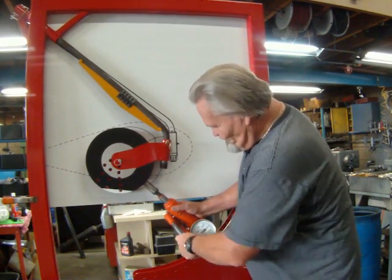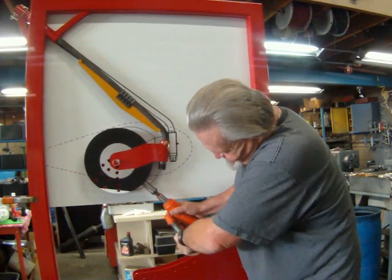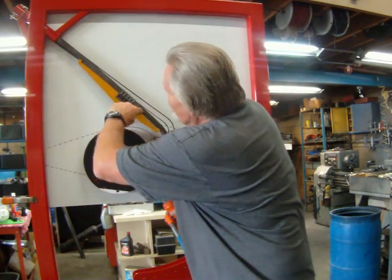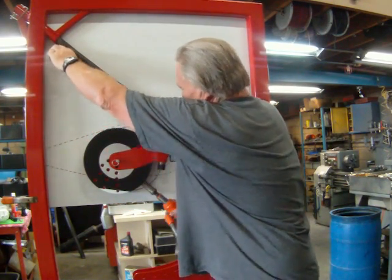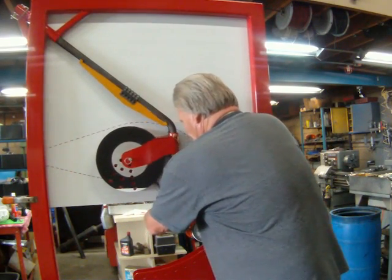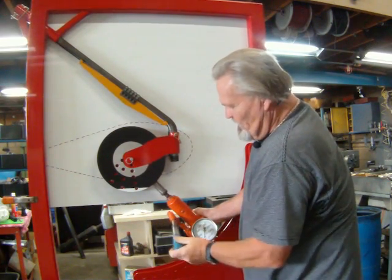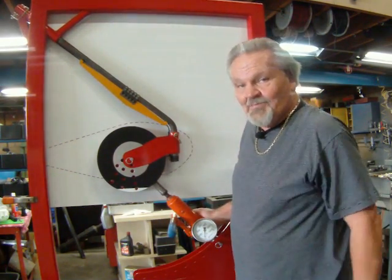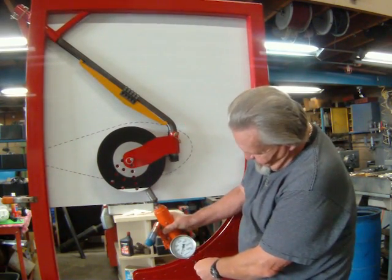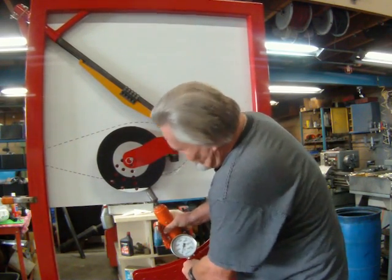Now, here's 800 pounds. And you can see there's no more bending going on here. It's all been transferred up. A gear leg without the brace would have failed by that point. So now let's move it back down to what you would see on a runway landing.